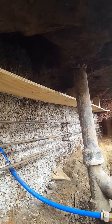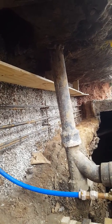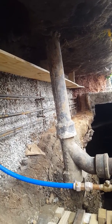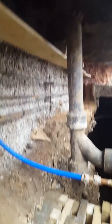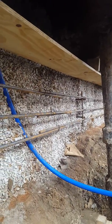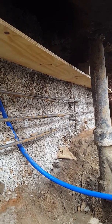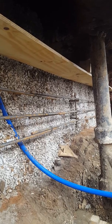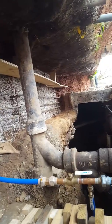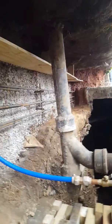Concrete is really good at compression strength, so you can stack a bunch of weight on top of it. Concrete we're getting today, I think, is probably 3,000 psi, which means per square inch it can hold up to 1.5 tons before it will break or turn into gravel. What I have is the half-inch rebar here in the hole, and that half-inch rebar has some crazy kind of test of like 30,000 pounds before it shears off. So what the rebar does is it gives tensile strength. Okay, so concrete's really good at compression, but tensile, being stretched and unsupported, it breaks really, really easy.